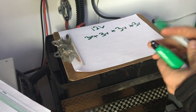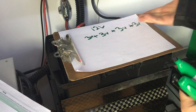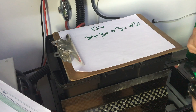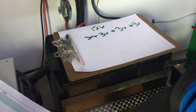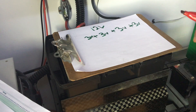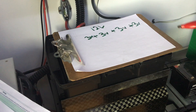Let's just say that if our battery goes over 12 volts, or any of these individual cells goes over three volts, that's a really, really bad thing — which it can be. What happens with these battery cells over time is when you discharge and charge them, they'll become out of balance.